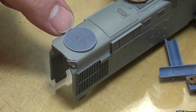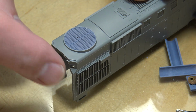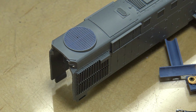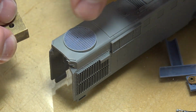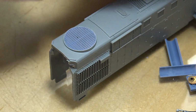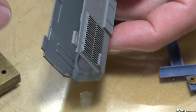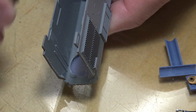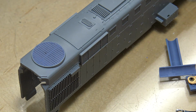The other thing that's really good about when I mentioned the shrinkage on this material is, right after this grill came out, I glued it in from underneath. I put this block right here. I put this on top. I didn't have the bolts in yet, so I put this on top and I glued it in from underneath, and that way when I glue it in, I can push it down against this block and get it even with the top of the housing.